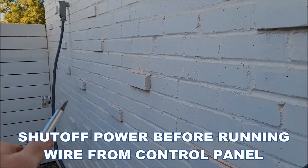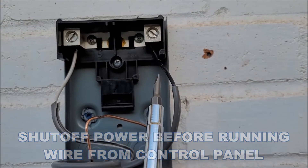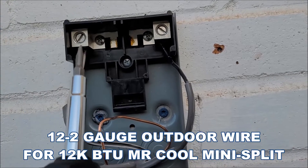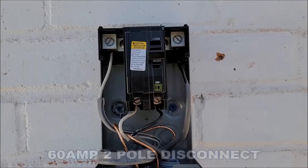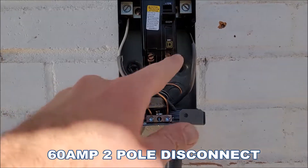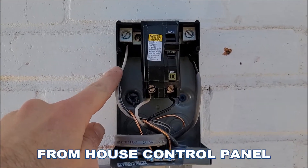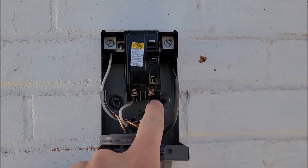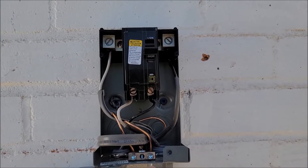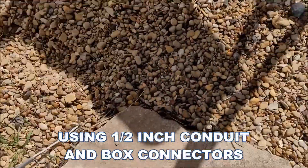From the circuit breaker I got all the way to here — the hot wire going here, neutral there, ground there, and the circuit breaker isn't plugged in yet. So this is from the circuit breaker: black, neutral, and then a ground. Then this one is going to go to the AC unit — it's in the circuit breaker here, neutral here, and then the ground. Now it's time to connect this to the AC unit.